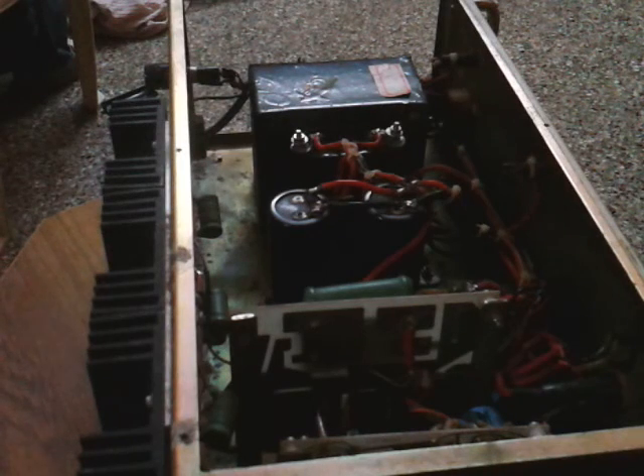This particular transistor I am checking for one of my power supply units which has gone bad. I am checking stage by stage to see what has gone bad. This is a linear power supply using 2N3055 banks, and I am testing the transistors one by one to repair it because the output is low. Thank you for watching and see you next time.